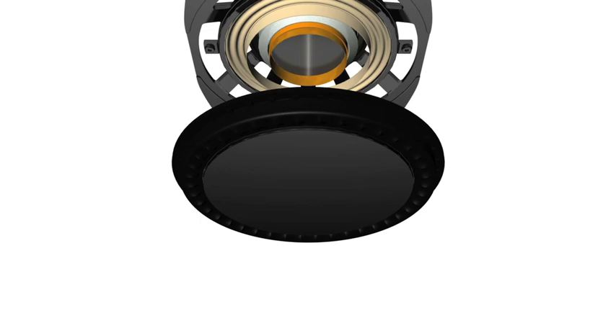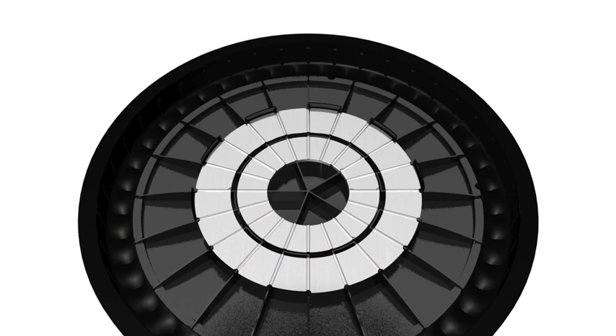So how did you do it? We started by designing a flat radiating diaphragm. This needed to have stiffening ribs on the rear, which were integrally moulded. We also mounted aluminium discs onto the back of the ribs to create a slim but very stiff structure.